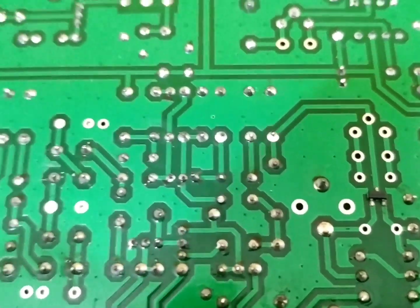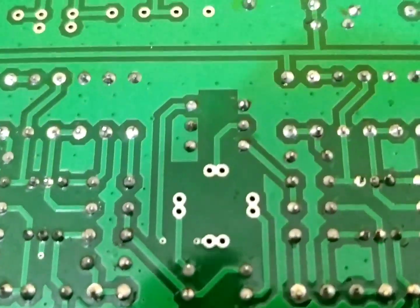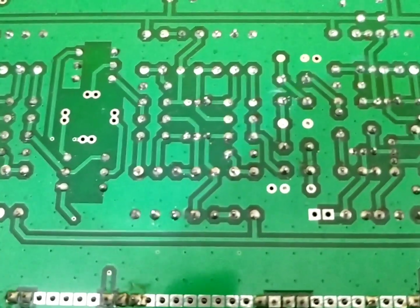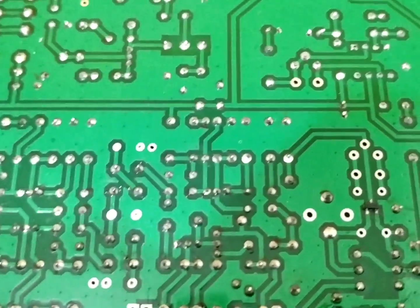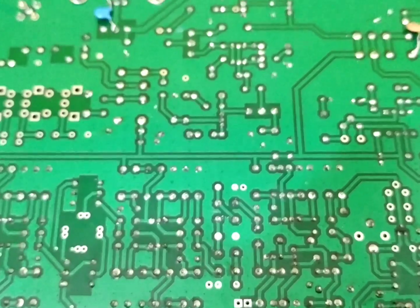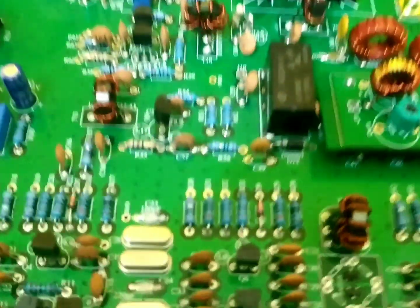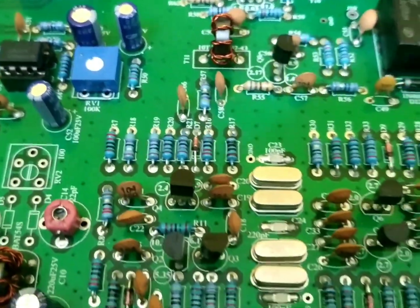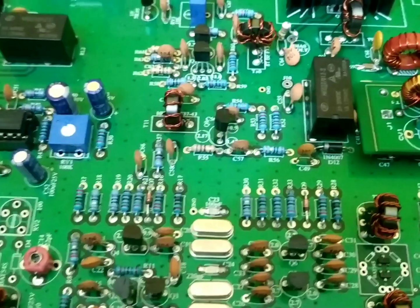Here is the BAT diode — the ones shown here are for the product detector and are mounted on the rear side of the PCB. The diodes for the mixer are mounted on the top of the PCB. So the product detector diodes are on the back side and the mixer diodes are on top.